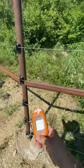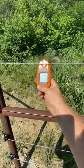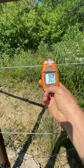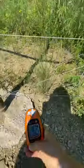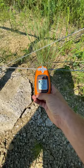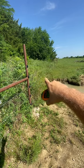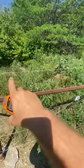Something to look for whenever you're using these directional fault finders: if you put this fault finder on the top line, which is energized, it's going to tell you that fault is down that way. If you put it on the middle line, which is also energized, it's going to tell you that fault is down that way. If you put the fault finder on this line, it's going to tell you the fault is right here. The reason for that is when you connect all three of those wires — top, middle, and bottom — you're creating a loop circuit.